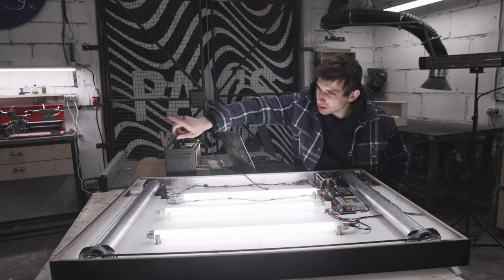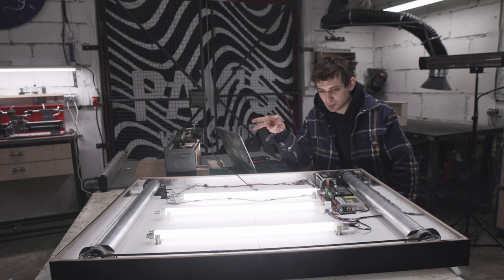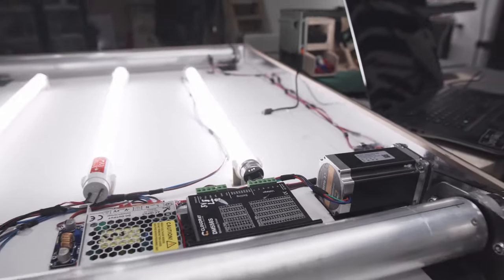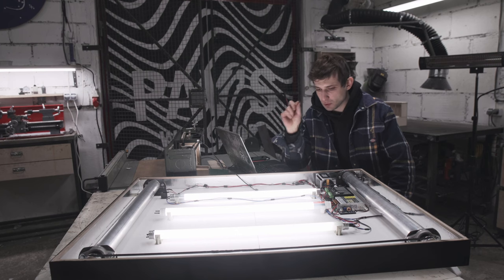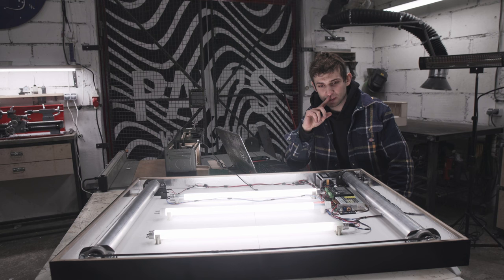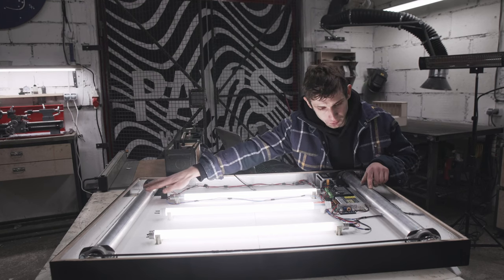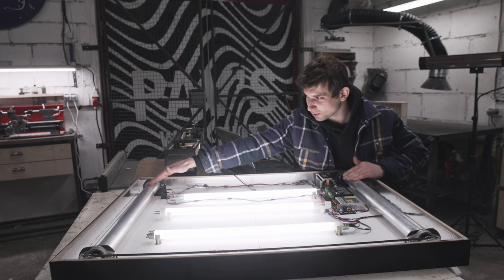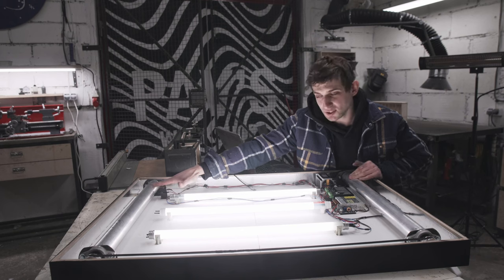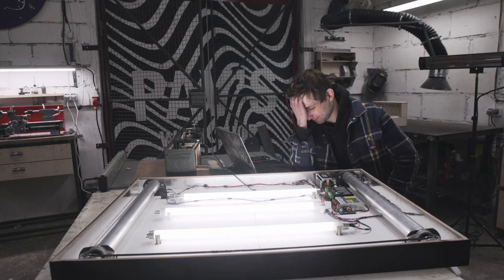You've probably noticed this little micro switch — it's going to set our zero position. If I turn off the power while the motor is working, the Arduino will forget its current position and might start from the wrong spot, which could rip off the poster. So every time I switch it on, it finds its zero position — the first poster — by clicking the switch. The poster is always stretched between the highest point of the rollers, and if the rollers spin too much the poster goes past the high point and hits the switch, then the motor steps back a couple of steps to set zero.